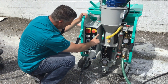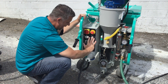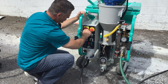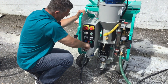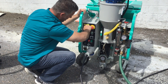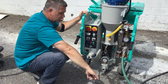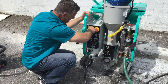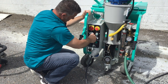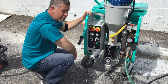Once you have your electric hooked up, we're going to check — this is a dual switch. No matter how you hook your 220 current up to it, this will give you either option. One way will be your reverse; you're looking for a blue light. If it's not that way, flip it the other way and you have your blue light. There's no switching of wires — it's a dual current, you can go either way. Your one way with the blue light is going forward; without the blue light is your reverse.